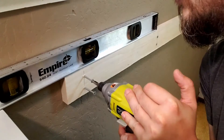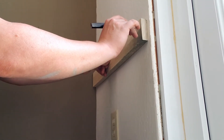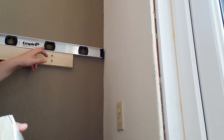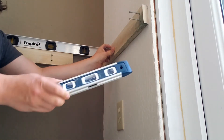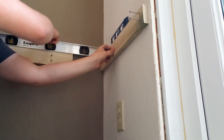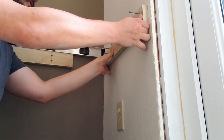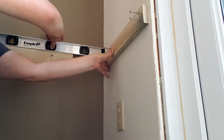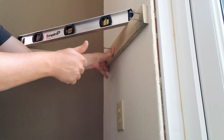Check again — okay, that's pretty solid. For this side, we're going to do pretty much the same thing. We're going to start by marking out the spacing of our studs. I know there's going to be one right here, and I'm reasonably certain there's going to be one right here too. I'm going to start by putting my level up on the original ledger — that's going to tell me where the inside of my corner is supposed to lie. This is where having a second level really comes in handy. You don't need a second level; you can always move the first level over, just mark the corner with a pencil so it doesn't get messed up. But a second level is super handy. Now this should be nice and level — you can put your level across both ledgers to confirm.